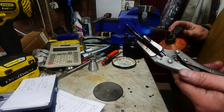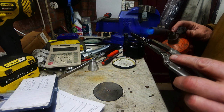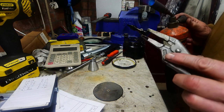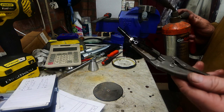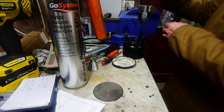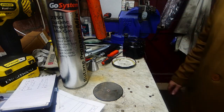I really don't have any particular technique for this, but a combination of old engine oil and a blow lamp, heating the part up, watching it carefully, dipping it in more oil and then letting it cool off, sometimes results in a half decent bluing of the part, turning the part black. Let that cool off.